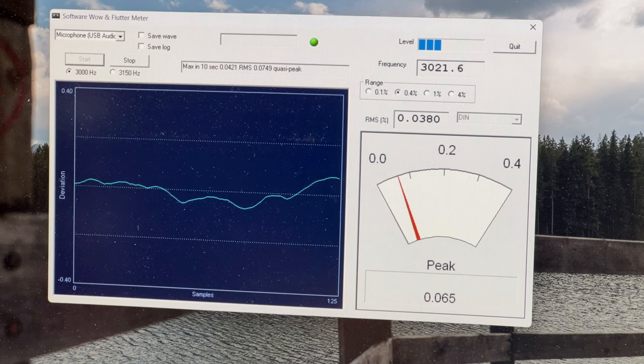This one is C133. Or no, it's C233. C133 is completely undocumented and is found right here. It is B39. That's actually supposed to be a jumper wire, but in this case, it's a capacitor. And what both of these capacitors do is they couple the Dolby circuits directly into the output. So they're very critical capacitors, and they're going to be easy to miss, so keep those in mind.